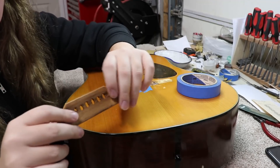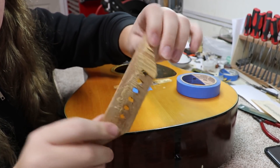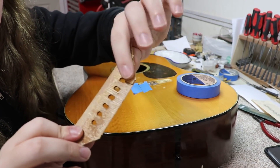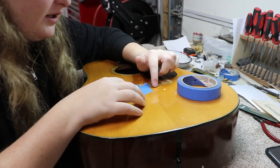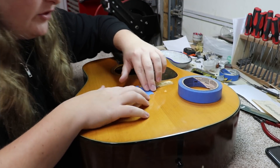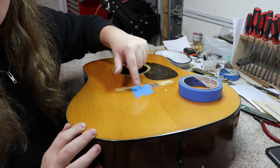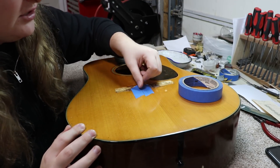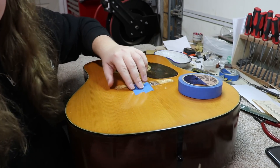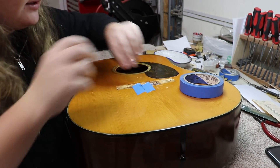After a long time trying, I took it over to Jerry and Jerry got it out. There it is - it pulled a little bit of the top off with it. We ended up with a couple of cracks in the top. I've got super glue in one of them here. We did the thing where we put tape on each side of the crack, get it as tight as we can, and then just run a bead of super glue. That should seal those cracks up.